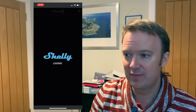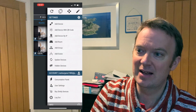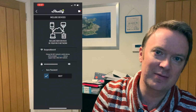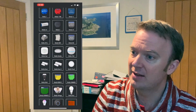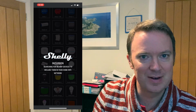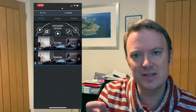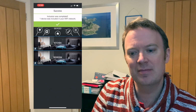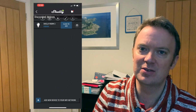Okay, now for a quick video on the setup process within the Shelly app. It's very straightforward, exactly as you'd expect. So within the Shelly app, you click on Add New Device, make sure that your Wi-Fi SSID and password is present, select the right device, so in this case the Shelly RGBW2, and then the rest of the process just guides you through it. It takes a few minutes. I've shortened some of these clips, but the whole process is seamless and very, very easy to do.